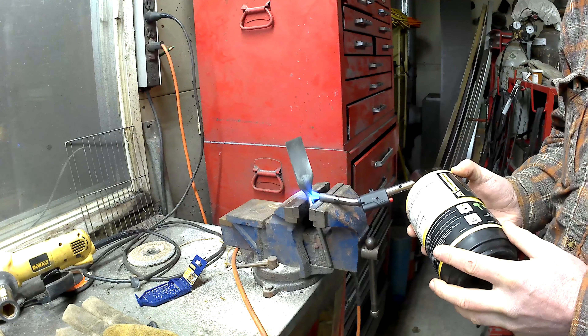Here's my second attempt at the bend. It turned out looking pretty good as you'll see, and this is where I stopped. I basically just eyeballed it to see if I thought it would work well with the handle. I never measured a real slick to see where it's supposed to be but this seems fine to me. I took it off camera and quenched it in cold water after the last bend. I think this will bring it back to good enough hardness for a hand tool that will see pretty limited forces applied to it.